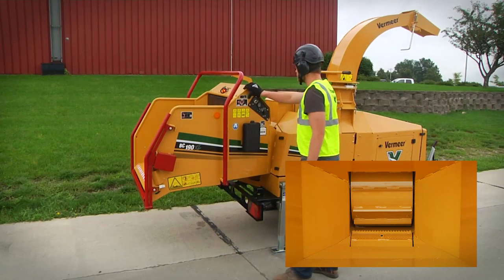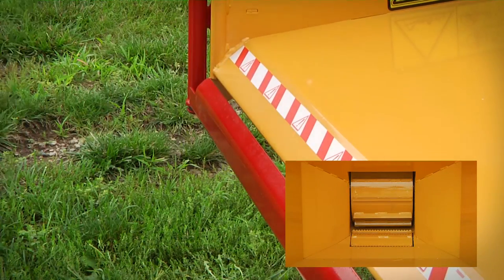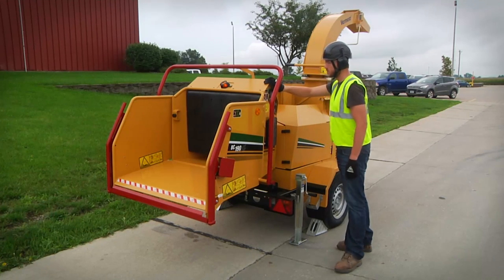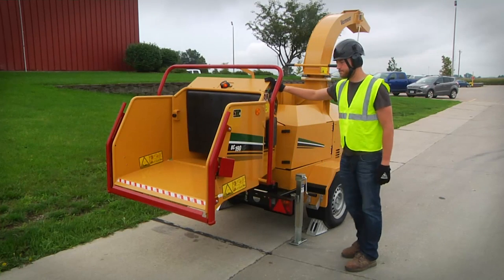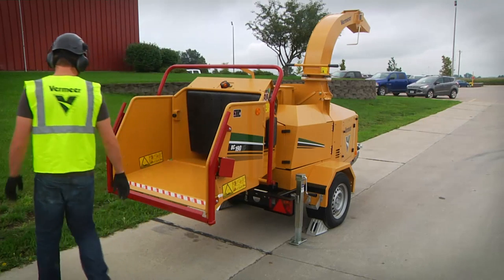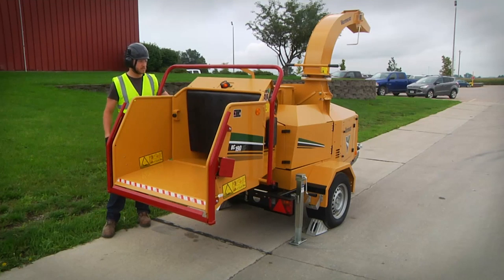The lower feed stop bar system and side feed stop bars provide a means for the operator to quickly stop the feed roller if snagged by a branch and pulled toward the machine. This system is intended for your safety and must be maintained in good operating condition. Do not operate the machine if the lower feed stop bar or side feed stop bars are not functioning properly.